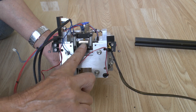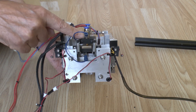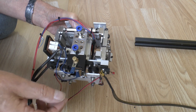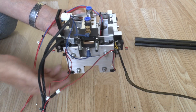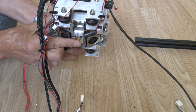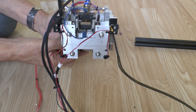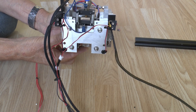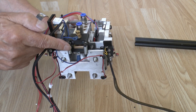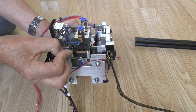You can see here the parts that form the switch. There's a brass plate on the bottom which is one half of the switch, and then this brass bolt fixed on the hot end mount, insulated from it because it's on a plastic part, which forms the second half of the switch. When the bed comes up and presses on the nozzle, it causes the hot end to lift, which breaks the contact - that's why the hot end is also the probe. As soon as it comes off, it breaks the electrical contact, and that's my Z home.